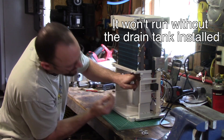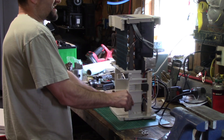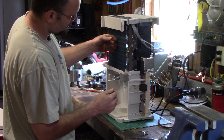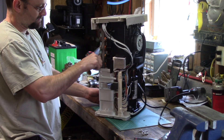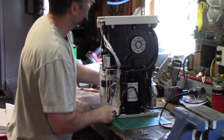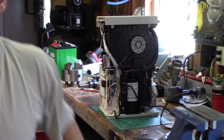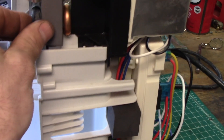I think it's this button right there — I'm just shoving a little wooden wedge in there to hold that button in. I was about to say it should kick on because it's more humid in here than I've got it set to, and it did — it kicked on. Compressor's running, coils are getting cold. So my problem is the blower's not running. Right there, that blower — that impeller should be spinning and it's not.